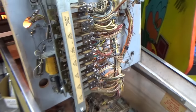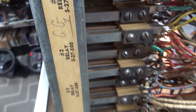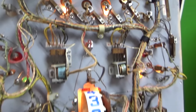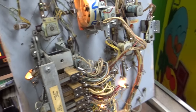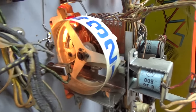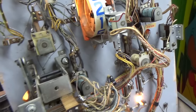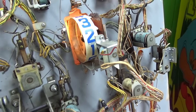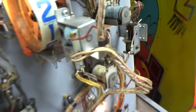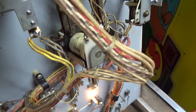I have cleaned all of the switches and everything on the bottom of this thing, including all the little trip switches. I tripped 2 and 4, which turns off the light at the top and turns on all the pop bumpers — I did that to make sure the pop bumper lights are working. I took this score reel that's right in the middle of the playfield and cleaned it up, cleaned the little horseshoe contact, cleaned the relays, and rewired every one of these pop bumpers. This one was missing a coil, so I swapped in a new one.